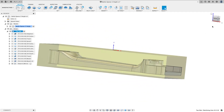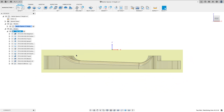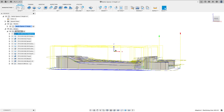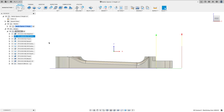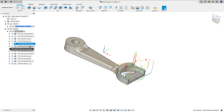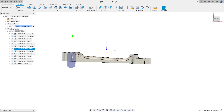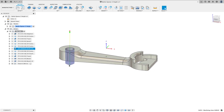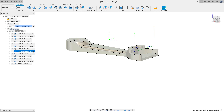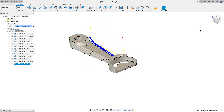If I take a look at my top-side setup, you can see how I have the work coordinate system set up — it's in the top center of the part, with extra material all the way around. One of the first toolpaths is an adaptive clearing that does the majority of the work, cutting past the bottom of the part. There's also a 2D contour, a trace to clean up material on the top, a spiral to clean up another face, more contours, a drill, a chamfer, and then 3D toolpaths with a mirror to do the other side. That's the CAM on this part.